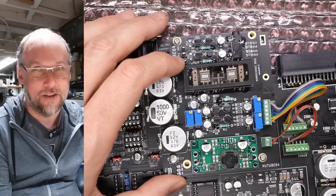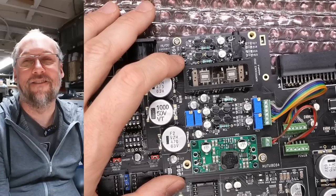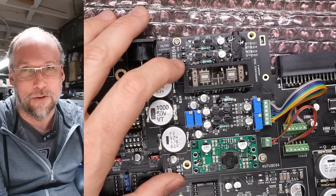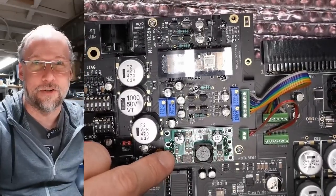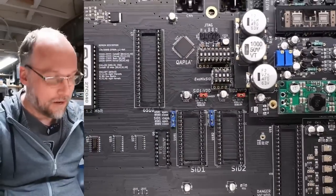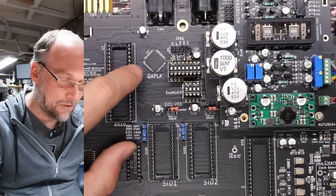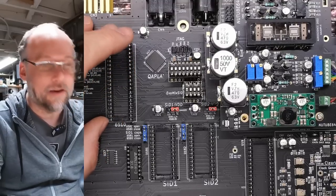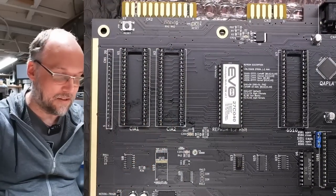The SID is a very noisy chip, and any smoothing you'd hope to get from the vacuum tube — well, maybe you can hear it. Dual SID support — SID 1 and SID 2 — so you can have stereo SID. There are DIP switches, and a QAPLA — Quad PLA — in a modern surface-mount replacement that's not going to break. You do need original chips though: the CPU and two CIA 6526s. Notice the RAM doesn't use normal DRAM. There is one original-style chip — 2114 SRAM — for the color RAM that the VIC-2 needs to talk directly to.